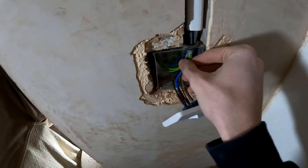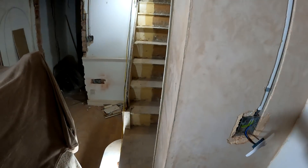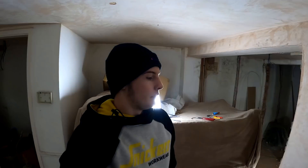That's all the intermediates done. To recap: we've got one here which is the first switch, one up there which is the bathroom one, and one above us - this particular intermediate system had an extra one in the middle making four switches total. We used the click modular system, swapping out the two-way to create an intermediate alongside it. Nick ran you through that - that's the end of the video and I'll catch you on the next one.